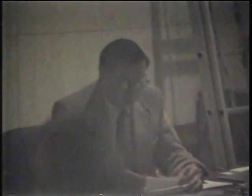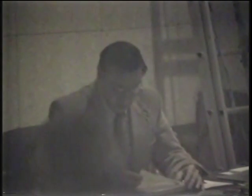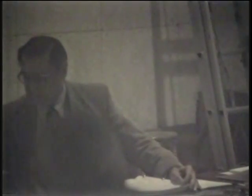Okay, page 13, we talked about the very top of the page, Beta 1 compatibility. Obviously, all our machines will play back Beta 1 without any problems, and this is no exception. And in order to achieve that, we have to talk about the fact that we have 4 heads on our drum, which comes on the next page. But at the moment, we're looking at the fact that our 4 heads are a little different than we are normally expecting.